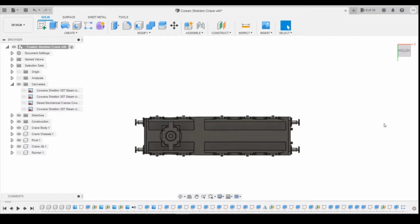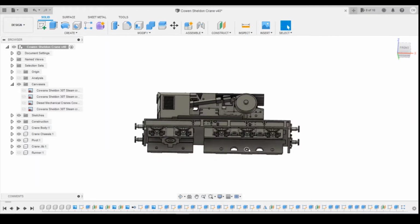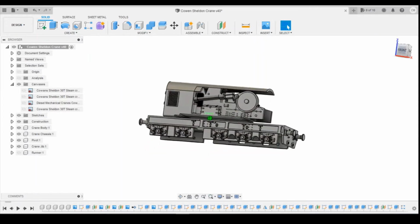The other is potentially this middle axle, to put a plastic wheel in there and just file off the flangeway, because potentially having these three axles by themselves would quite happily go around the corners, but when this was added it wasn't able to. So potentially taking this middle axle out might give that a little bit more flexibility. And then the third option would be to turn this into a bogie by itself, which is the least desirable of the options, but it's something that might have to happen.